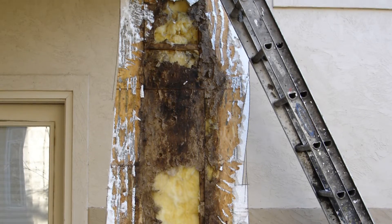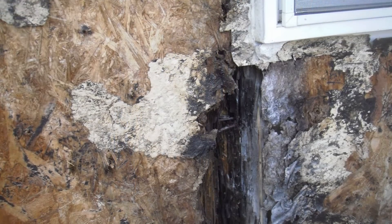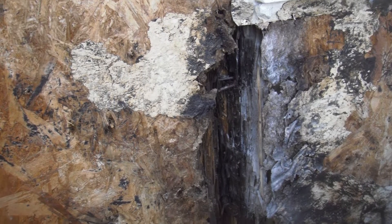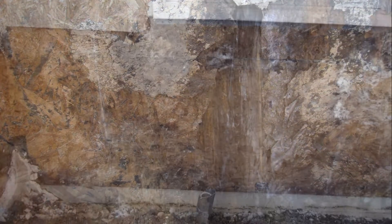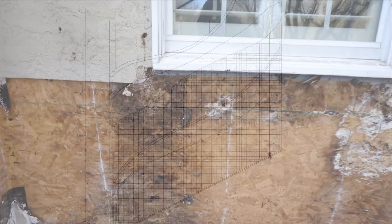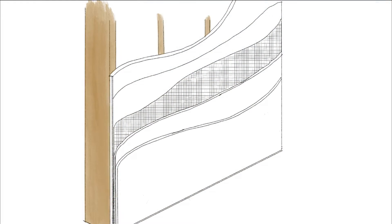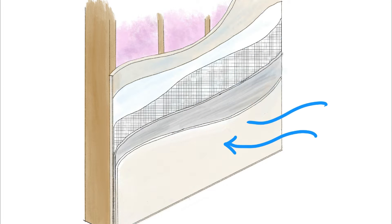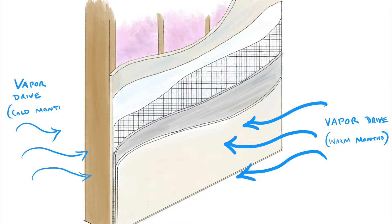If there isn't a place where water can drain out and dry behind the stucco layer, the wall becomes saturated. Over time, excessive water and moisture inundate the weather barrier, and hydrostatic pressure drives water through any seams and penetrations in the membrane and into the sheathing and wall cavity, resulting in mold and rot since this moisture gets trapped — with help from the insulation, which impedes the drying process. Vapor drive can also exacerbate the problem, especially if the sheathing is already saturated, leading to more moisture problems near walls.